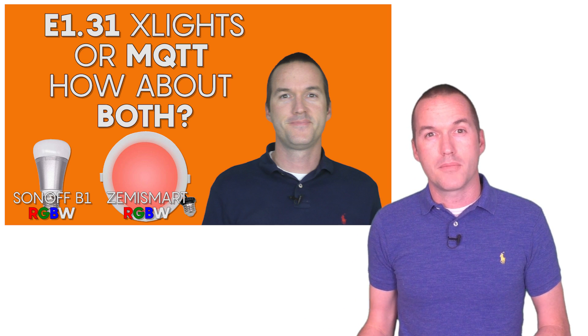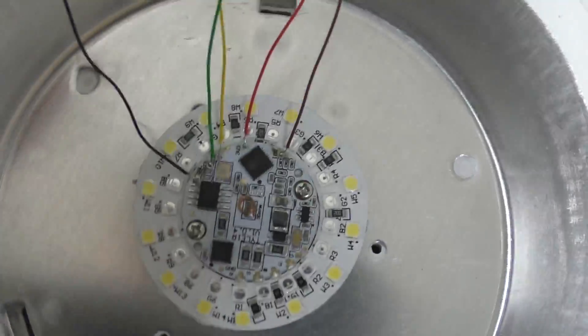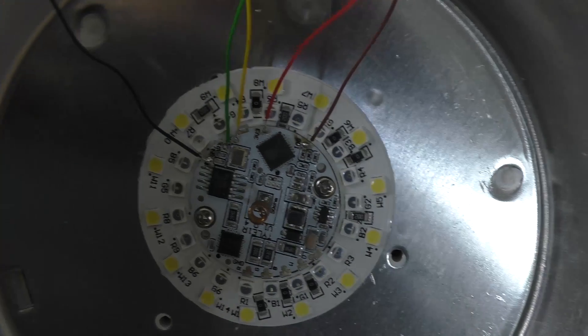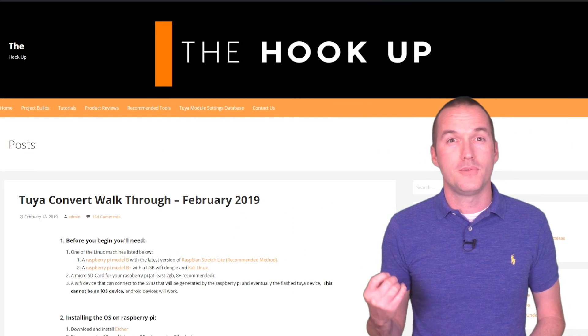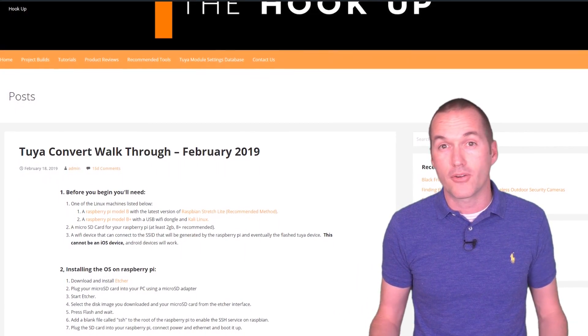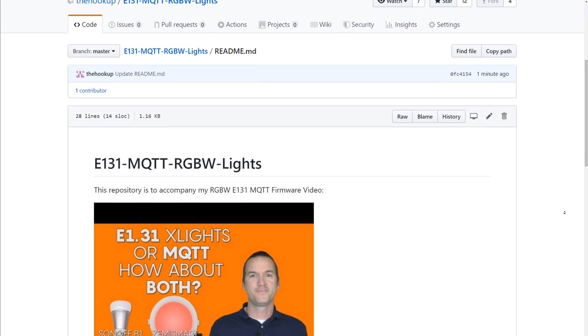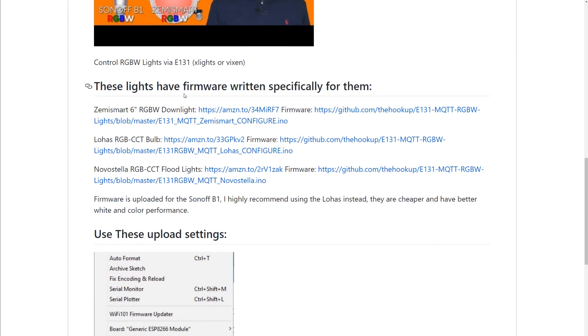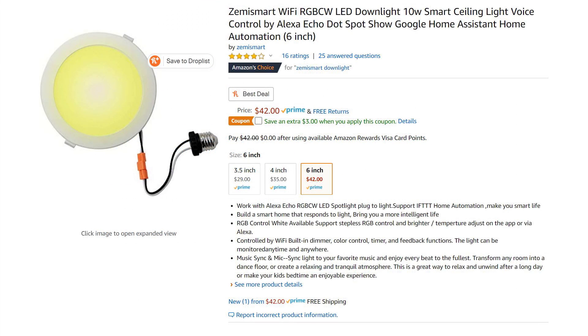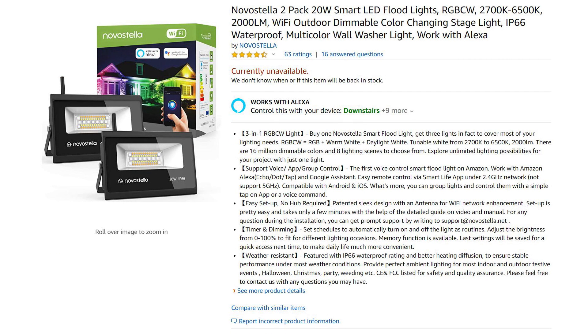The last thing I wanted to talk about in this video is RGBW lighting, which I actually covered in a video last year, but it's significantly easier to do now so I wanted to do a quick update. Last year I showed how to take apart a 6-inch RGBW downlight from Zemismart and use Arduino to reprogram it, but it required soldering. Now an easy-to-use Linux script called Tuya Convert has made it trivially simple to install custom firmware on anything designed to work with the Smart Life app, without taking anything apart or doing any soldering. These lights work with common ESP8266 firmware like Tasmota, but I've also written my own firmware for a handful of products to control using the E1.31 protocol and Xlights. I'm specifically using Zemismart 6-inch RGBW spotlights on my porch, LOHAS RGB CCT bulbs in my carriage lights, and Novastella RGB CCT floodlights for a wall wash effect on the front of my house.